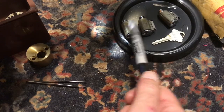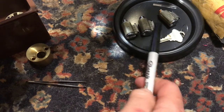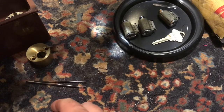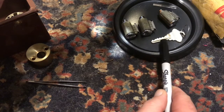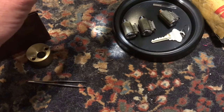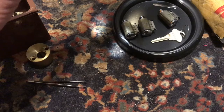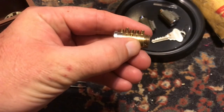The drivers were weird - they had all been replaced with reversed T-pins, so there wasn't a whole lot of pin up in the driver section to work with. And you can see from that bitting, that doesn't leave a whole lot of interesting stuff with the key pins either. It's pretty much a straight middle-of-the-road cut.